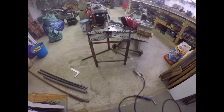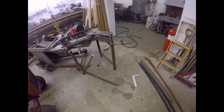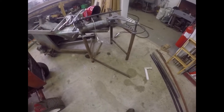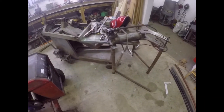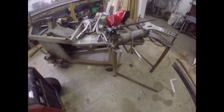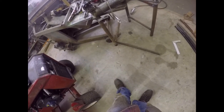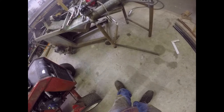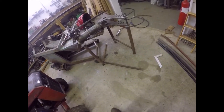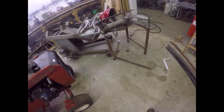Right folks, there we are. All welded up. It's 20 past 1. I've been effing about in my usual fashion but that's nice and square and flat - you can put a square on it. I prefer things to stand straight and not wobble. I've actually slackened that off and set it accurately with the engineer's square before I started using it. So now we're going to get a solid measurement from that point over there to this point here and cut another two pieces of box section and two pieces of tube. I've put the box section at the bottom so we can put a shelf on there. The tube is just literally scrap water pipe I've got from somewhere.